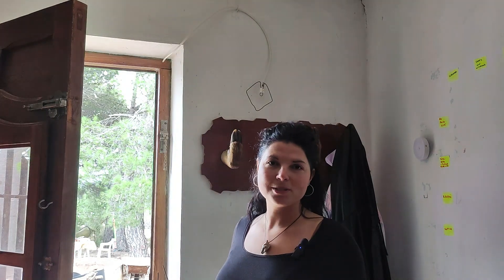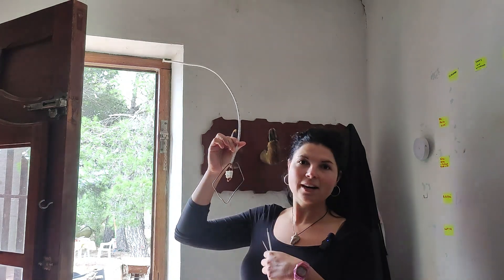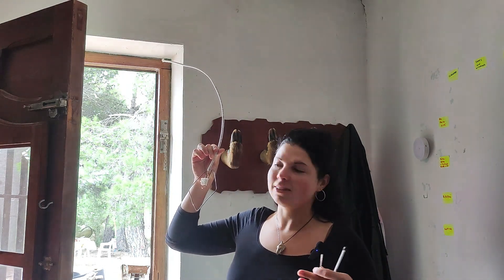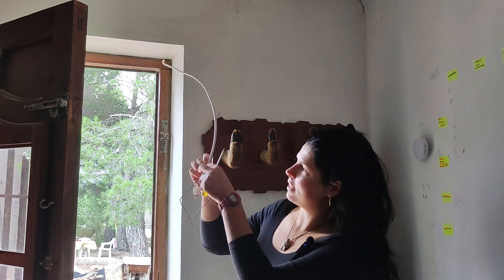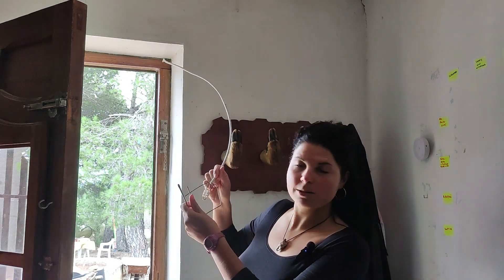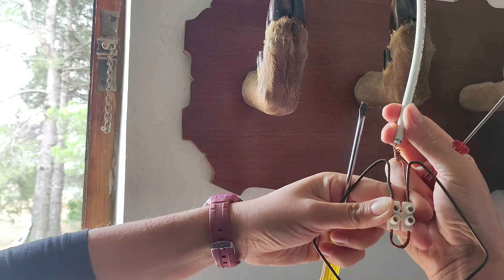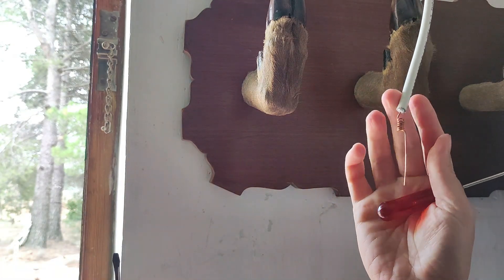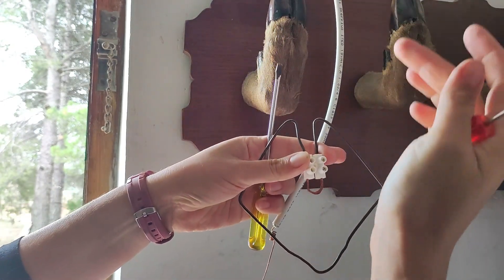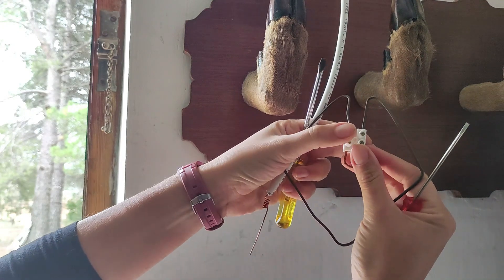So how to reposition the cable? This is the end that goes inside the house. If you put it together yourself it won't be a big mystery, but I'll show for those who are thinking about doing this. There is a connector here — we need to disconnect this part of the cable from this part to pull it away. There are two screws here; I'm unscrewing them and disconnecting it. Now I can pull the cable up and reposition it to where I want it — inside the house, not on the facade — then put it back the same way and screw in the two screws.